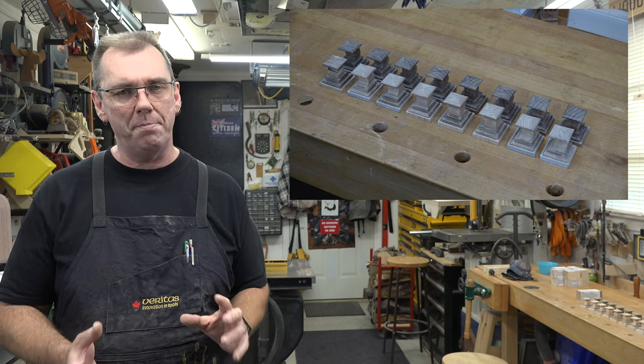Now, I'm not going to say it's perfect. It needs some filing here. There's a little bit of a ridge. It needs some sanding. But all in all, it's a beautiful piece and everything is lined up really nicely. So just remember, blade entry holes can help you. And again, I can't stress enough to keep that blade square to your table. So with that now, let's cut the other three bishops and then we'll move on to one of the other pieces. And after some time, you'll end up with your four bishops cut. Well, I'm going to move on to the rook.